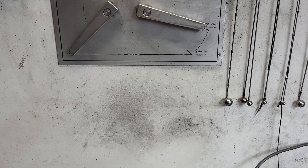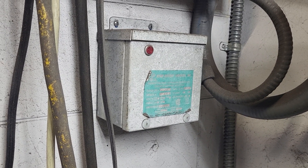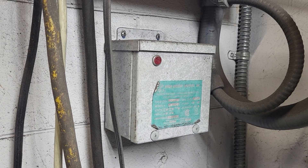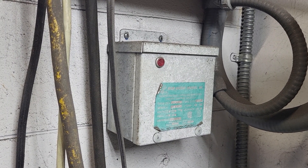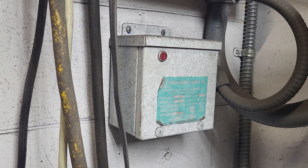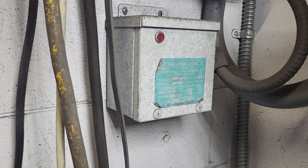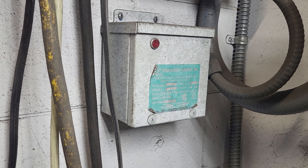There's one other little tidbit — you're not going to see that often. That's actually a power factor correction box. I run that while I run the bench. The theory behind it is it straightens up your phase angles between your voltage and your current when you're doing an inductive load. Does it actually save me money on the bench? I doubt it, but it definitely is a huge surge suppressor. If we had a voltage spike or anything, that would probably protect my bench and my motor controller. I can't imagine what SuperFlow gets for a motor controller — I know what they get to replace a Flocom, and it's nuts. Most guys don't have that; I have it because I'm a little nutty.